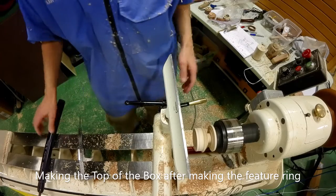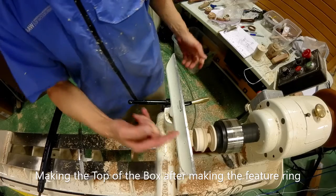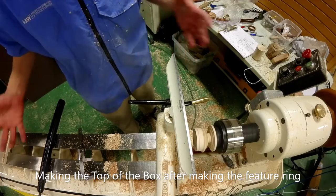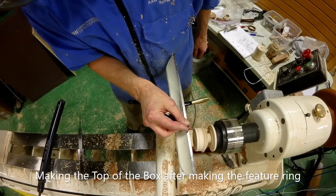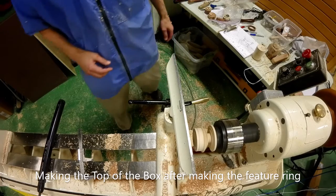The vibration comes because the tool has a thin diameter and it's far away from the tool rest, so you change it by a bigger tool, bring the tool rest closer. I do that, but I also want to have an indication so how wide I want to have that rim, and maybe just something about that.